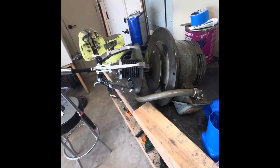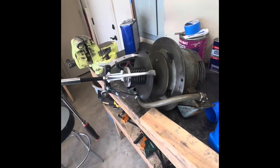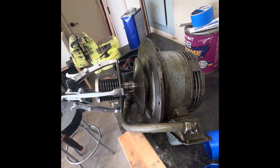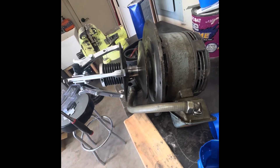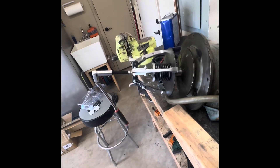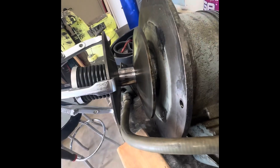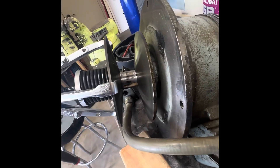Accelo's manual actually tells you to stick a block of wood in here before you pull it off, basically just to keep this thing wedged apart so it doesn't pull in on you. But when the belt breaks, there really wasn't a way to get a block of wood in there. So I decided to use this three-jaw puller — pulled it back really easy. I think I should be able to put the belt down in there, and if I'm looking at it correctly, the belt should hold it apart so that we can get it assembled.